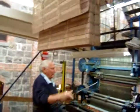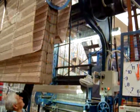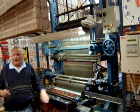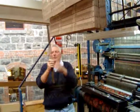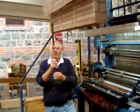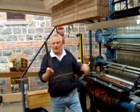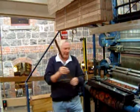Now you can see that from where you are. Yarn carrier, carrier wire. Do you see where the wire's finished? Up on the top of my cradle up top? Great. Every one of these yarn carriers, by means of a wire, is connected to one of these. And this is called a peg carrier. They're my pegs, obviously, and our pegs are very important. Each one of these pegs corresponds with a colour down here. I've got black, grey, red, maroon, green and so on down the line, okay?